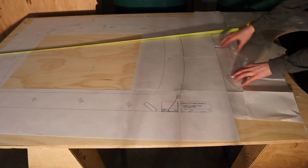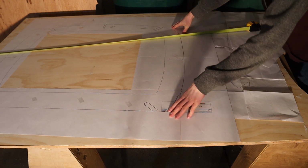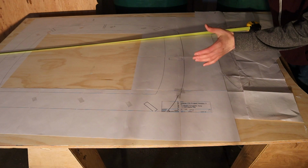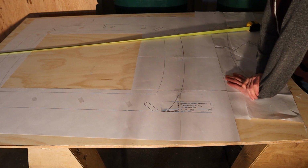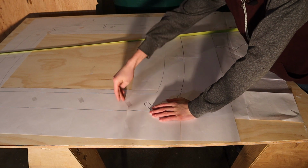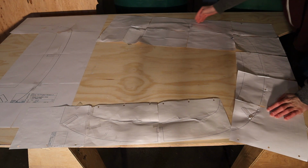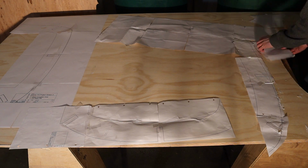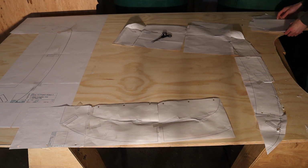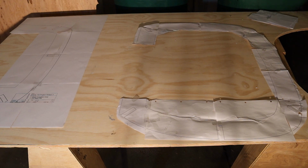I'm actually going to start with this profile 2, and then shift it over here, and then do this one last. Because if it turns out good, I can just turn it a little bit, and then it'll all be good to go there. But if it somehow doesn't fit when it's all glued, then I can actually just cut a little bit of this portion off and have it have no bottom structure here. I'm actually going to cut around this whole section so that I know more accurately how to cut it. I'm offsetting it about 1 inch probably, just so that the glue has a place to hold. So we can test out how much this is taking up and then measure that and subtract it from 65 to see how much space we have left.